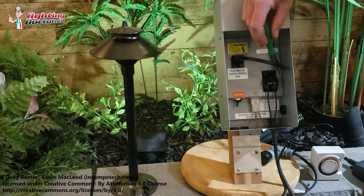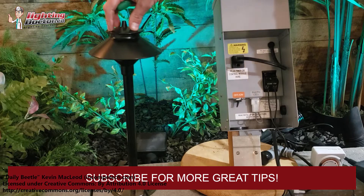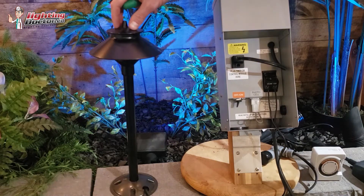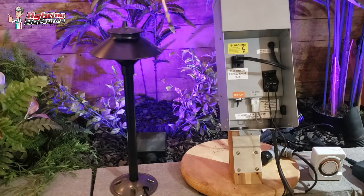The reason for the 15-volt tap is that any good quality — I'll call it a professional-grade landscape light — is going to run anywhere from 9 to 15 volts.